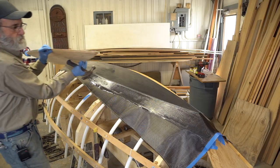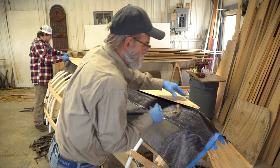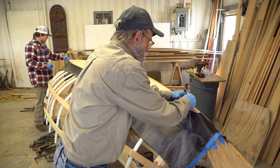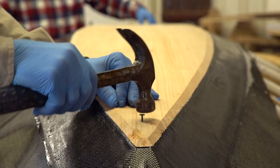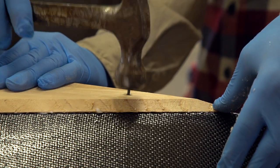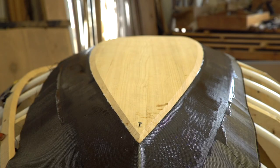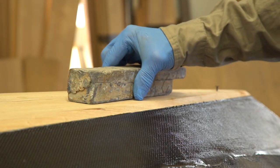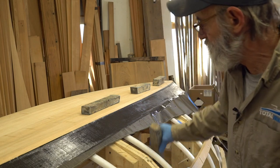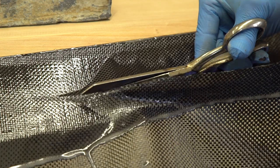Joe and I are going to carry that second layer of bottom planking into position. We've got our original nail holes so we can line it up exactly where it belongs — it has to be lined up perfectly, this is a precision sort of build. We'll place it down, drive a few nails in the original holes, pick up some lead weights and spread those around the bottom, then wiggle the bottom planking back and forth until we make 100% contact between the three layers.